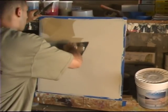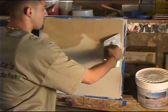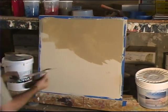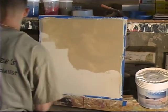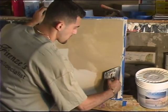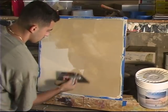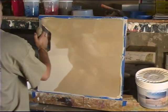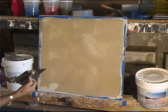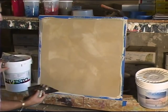As we watch, Gian is applying his third coat. As you can see, he's not using a lot of material. It comes back, kind of regenerates the product on his trowel, adds some more material, combines them together, and continues. When your second coat is perfectly, very, very smooth, it doesn't require a whole lot of material on your third coat, and you see that he doesn't need to use a lot of material on his third coat.